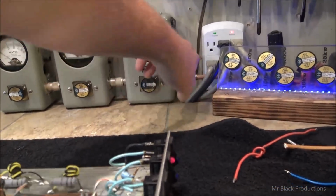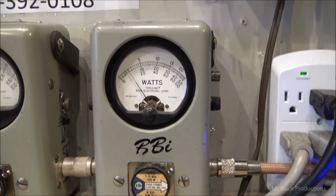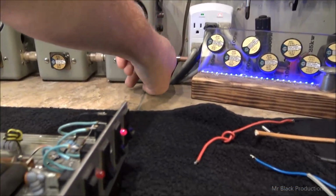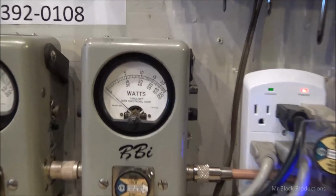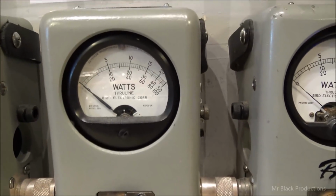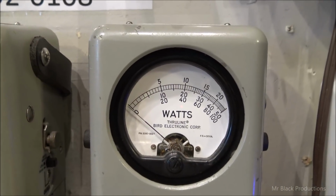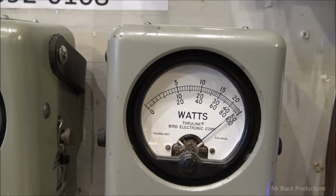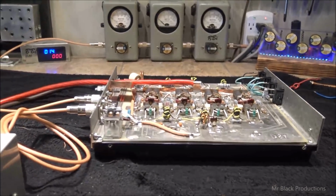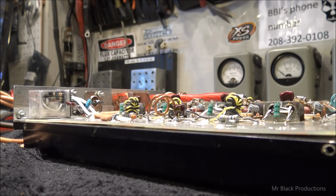We're going to leave it at 1x, click the amp off, kick on the 2-pill. About 400 watts of drive. Now we can go to the 2x. 400 watts of drive. 1850 and some change. About 600 Bird, 550 Bird. Now this thing's working like a regular, straight, normal, what we'd expect to get out of 8 Toshiba 2879 transistors.